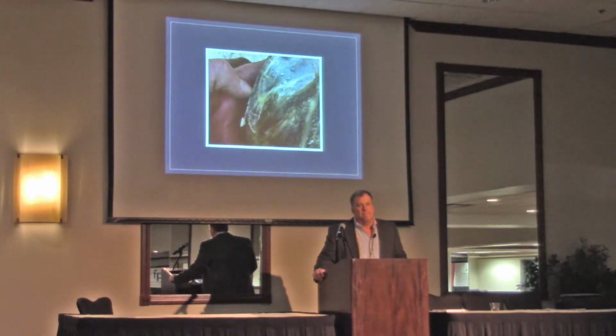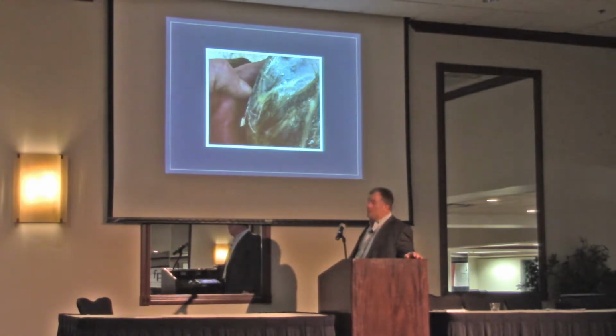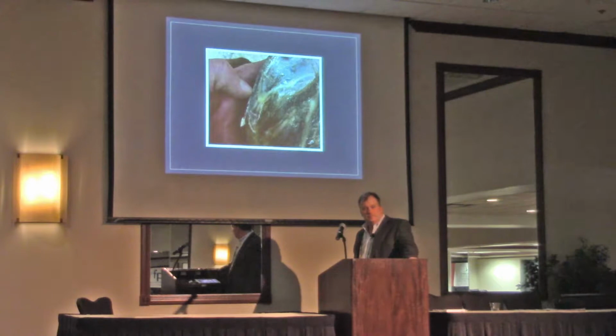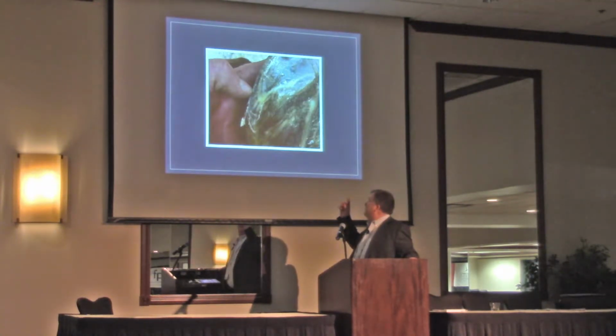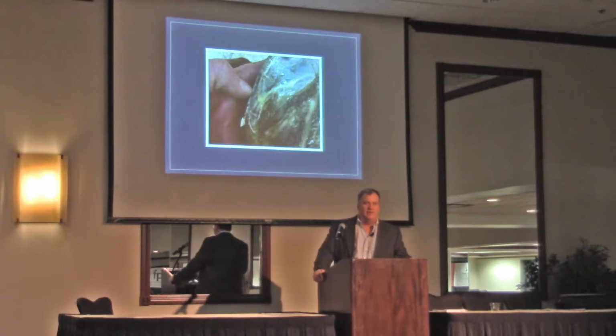From the apex of the bars there, drop your heel, just rest your heel down like you're floating. Just take it back till it reaches the widest point of the frog. It'll create a little bit of a space between your heel and your shoe, but it'll allow it to drop down. It'll help the sheared heel, so you see a nicer foot next time. Well, I've actually done, I have hard bars on this horse. Well, you don't need the hard part.